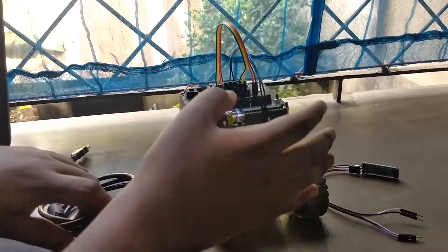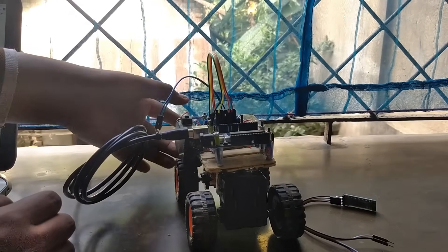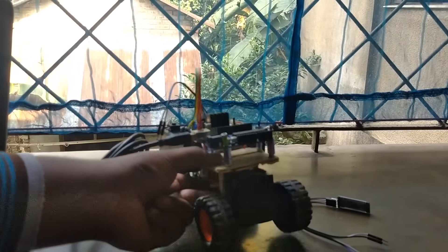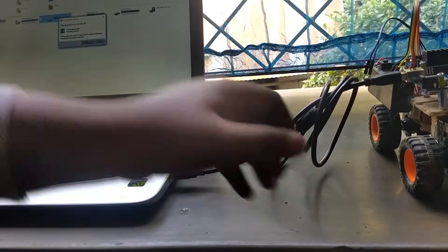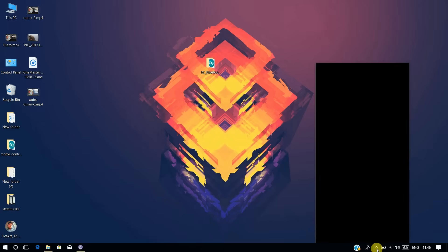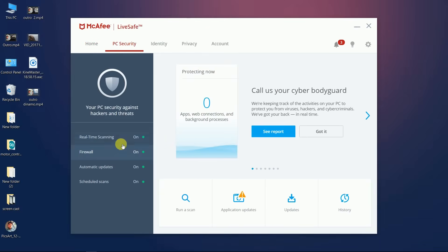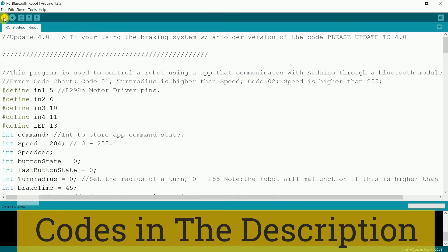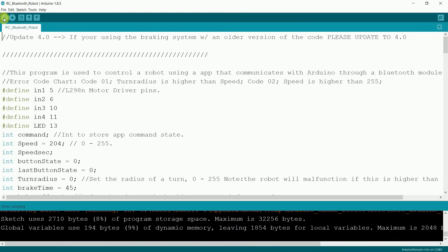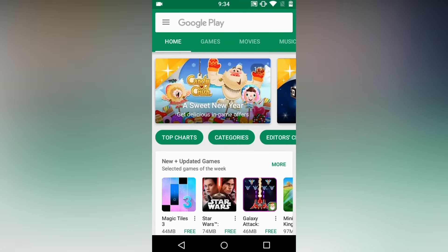Now I am opening my laptop for coding and uploading the code to the Arduino. When I first tried to upload the code, it said the code could not be installed. I searched on YouTube and found the solution: disconnect all wires and then upload the code. I also disabled my McAfee antivirus real-time scanning for better performance. I turned it off for 15 minutes and then opened Arduino Uno R3. The codes I'm uploading to the Arduino are in the description box below. If you have any problem with the Arduino codes, comment below and I will try to answer.